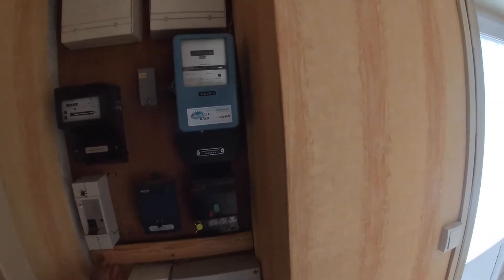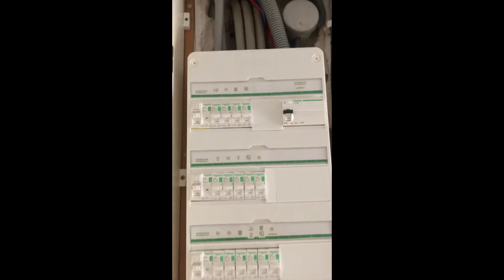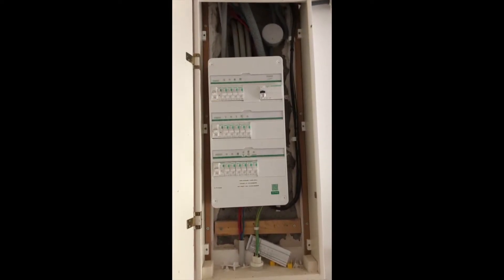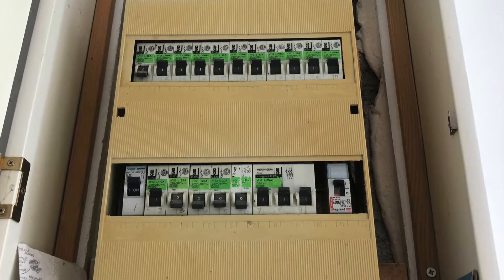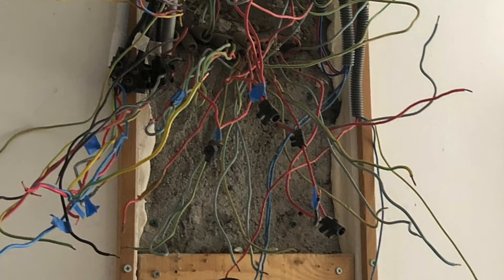Generally the standard of electrics is poor — it's very home-made, but that's usual. Let me show you an example. This is the one at my dad's place. You've got the main switch going across the ceiling, down and into this box. I've put a new consumer unit in — it's three phase so I've marked it as such. It didn't always look this tidy; I redid it when doing an extension. This is what it used to look like on the inside — yeah, pretty bad. I had to take it right back to the original wires.